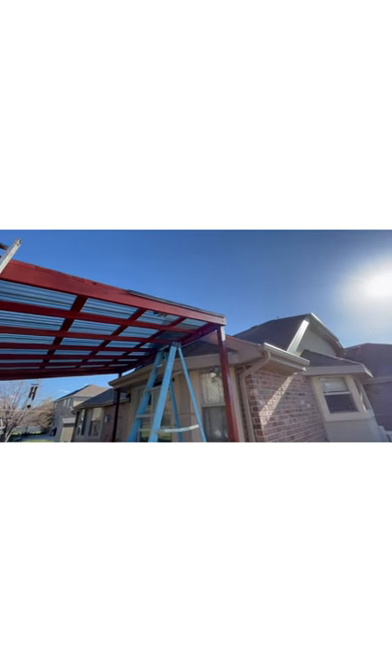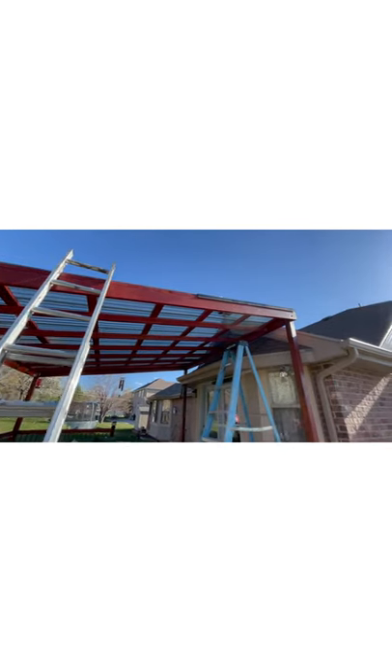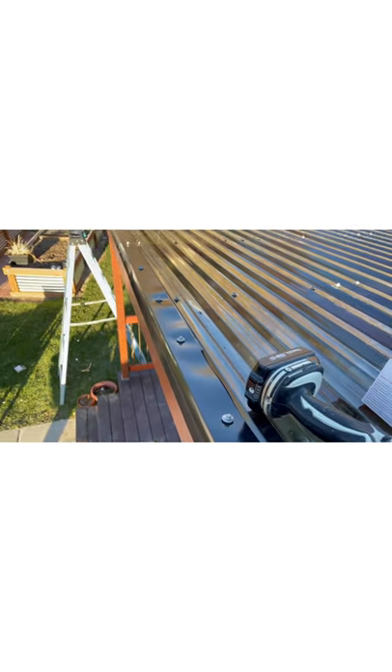The directional winds come in from here to there, so I put a drip edge sitting on top of the corrugated plastic. I've installed it along the back side, and now I'm going to install it on this side and that other side all the way. That drip edge will protect the wood and also help keep the wind from blowing off the corrugated plastic. The water will drip from here instead of straight down, and it'll keep the wind from getting underneath and blowing off the material.